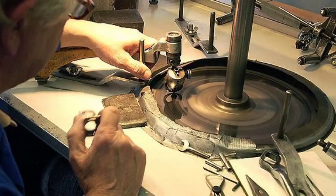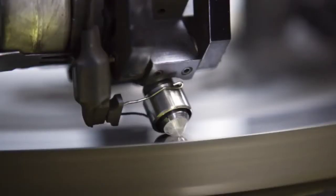The last step is polishing. Polishing is done by polishing machines using a rotating disc or plate made of cast iron that spins very fast. The gem cutters apply diamond powder mixed with oil onto that plate, and place the bruted or shaped diamonds on these spinning wheels to cut and polish them in various styles.